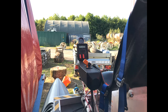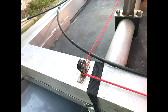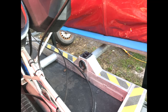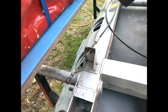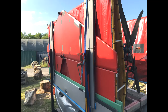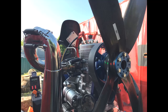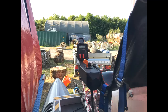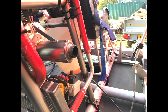It's definitely one of the coolest machines I've seen. He let me sit in it and I imagined what it would be like to fly — the main thought that crossed my mind was one of trepidation, and that, my friends, ticks the boxes. There is an aluminium square-section framework attaching everything together, with a way to adjust the position of the engine and seat via clamps to fine-tune the balance. The elevator and ailerons are controlled via push-pull cables and the rudder via paraglider line and pulleys. There are two wing spars per wing and they slide one over the other for assembly. The tail also gets assembled at the waterside, and it takes around 45 minutes to get it flight-ready. There are loads of things to think about in the design of this project and lots to learn, which I'm really looking forward to.